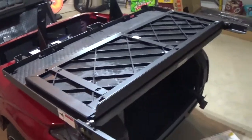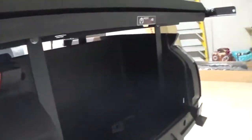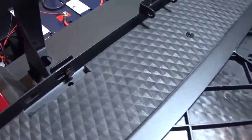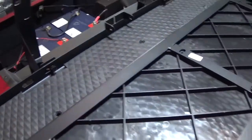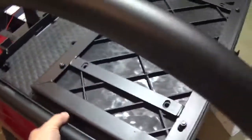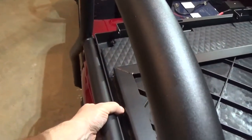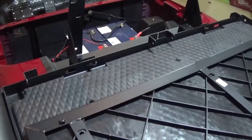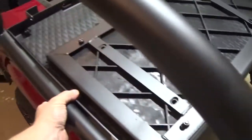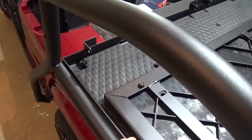There we have the platform kind of sitting on there and nothing is tight — I've just got everything loose. The reason being, everything is slotted. There's a good reason for that because when I mount part of my tower top, the angle is just all wrong. Because everything's slotted, I can line everything up just perfect. So leave everything loose, that way when you go to pull everything together, you can kind of line it up and then tighten everything down.